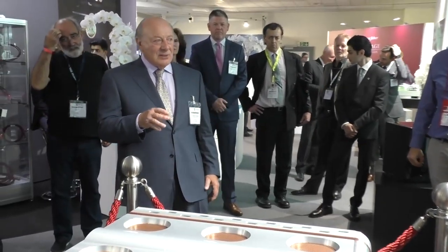Along with an extraordinarily quiet power supply, we have a multiple domain power transformer that's laminated in a certain way to make it have no noise. Then it's surrounded by wraps of silicon steel, and then it's potted into a steel can so that it's totally quiet electrically and mechanically. It's got 600,000 microfarads of capacitance in the old way, with big can capacitors that you don't see so much anymore because they're so expensive, but they have their own problems. They resonate. They're big hollow cavities. So we have an acoustic damper built in that clamps them in and grounds them to the chassis so they're dead quiet. That's coupled with big copper bus bars. I come from an era when we built big amplifiers and used big copper bars, and that's what this amplifier has in it.